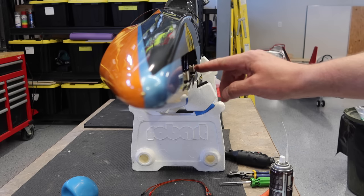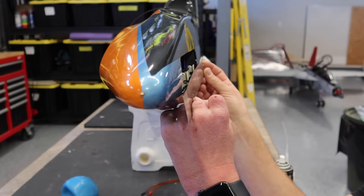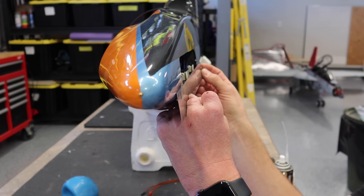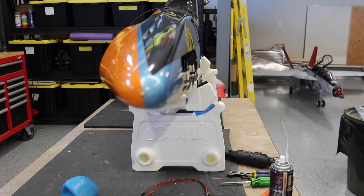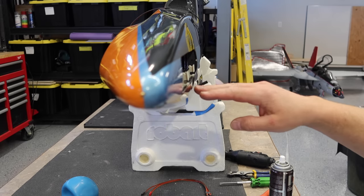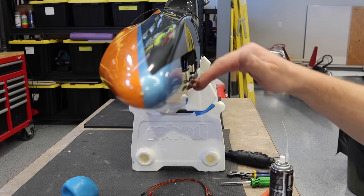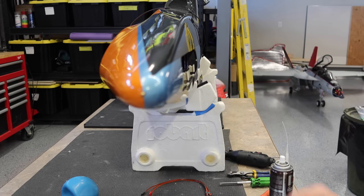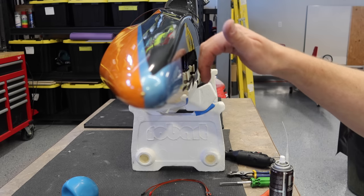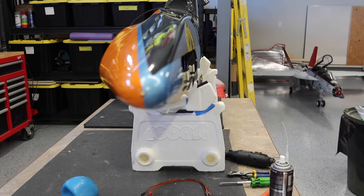And then the other key is if we take a straight edge right now with them all closed and I run them across the center big holes, all of those holes line up perfectly. So now what happens is those hinges are gonna work together when this door opens. If you get them in different positions, the hinges will fight each other, and it's gonna bend your door funny, it's gonna cause extra resistance. So you want that to get lined up as straight as possible.